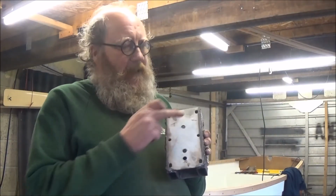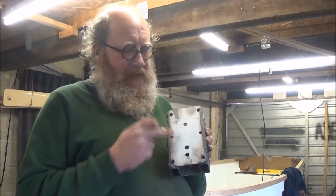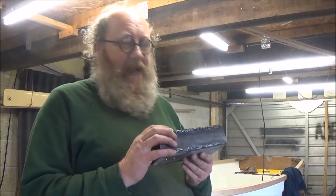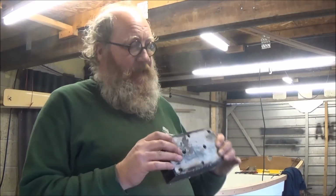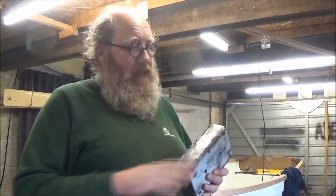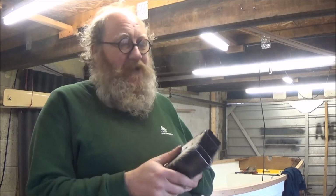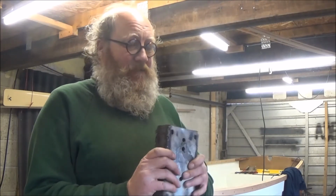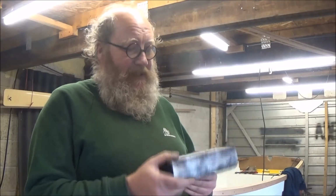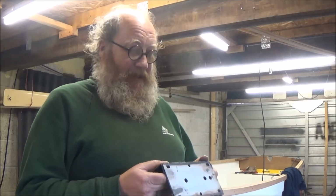It's getting quite heavy. I'm going to weld the six holes down the sides to the tops of the box section, and then I shall be grinding. It's Sunday today, so I won't do it today. I'll grind the weld flush, or as flush as I want it, and that will make it a bit neater, and people won't be afraid to touch it anymore.